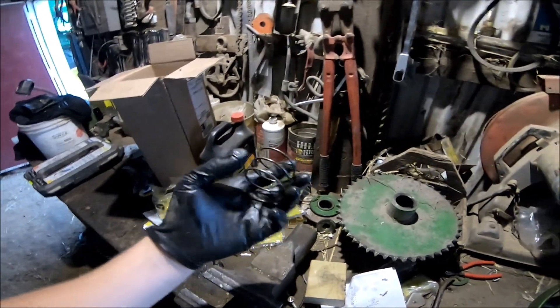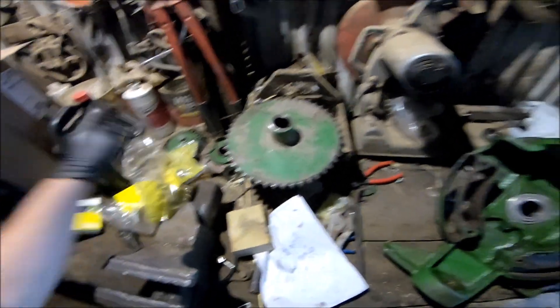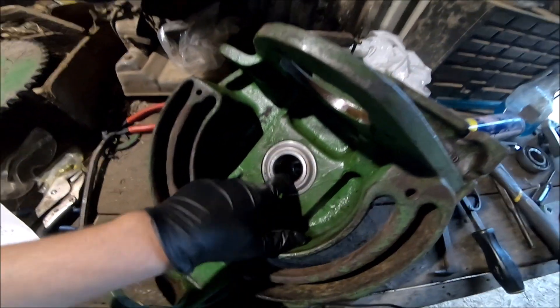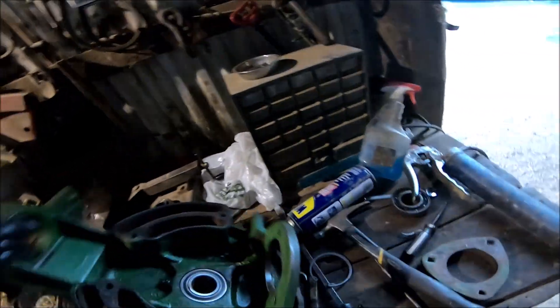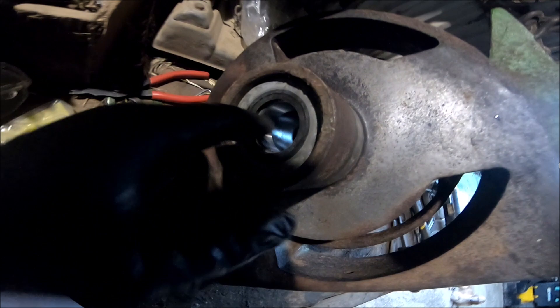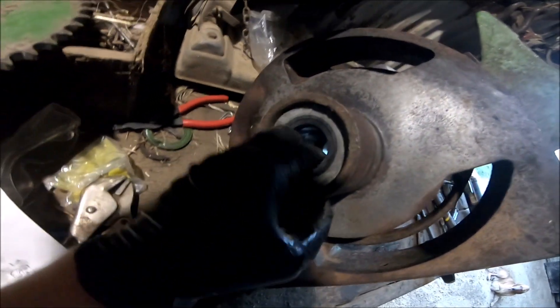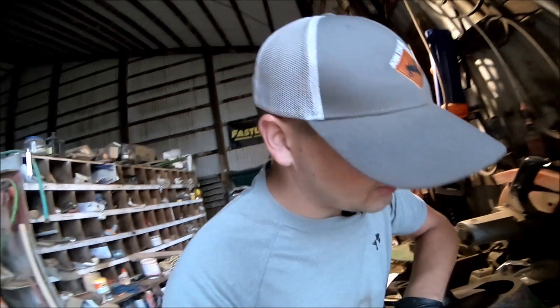It was pretty important to make sure that this spring — the old one is in pretty good condition yet — but its only real purpose is to make sure that it is moving grease from this zerk fitting and pushing it up into the top bearing. I made sure they are pre-greased bearings, but they're open to a certain degree so they're able to get grease later on.